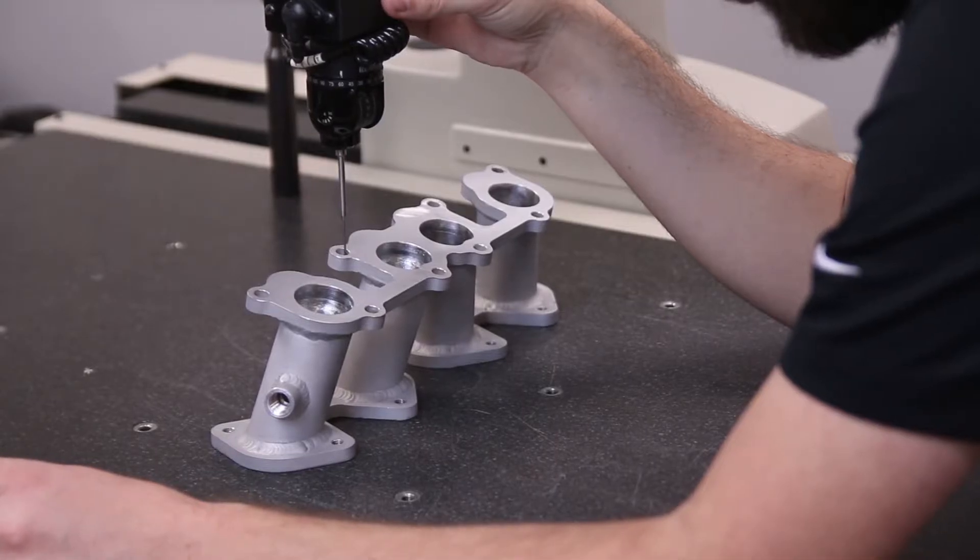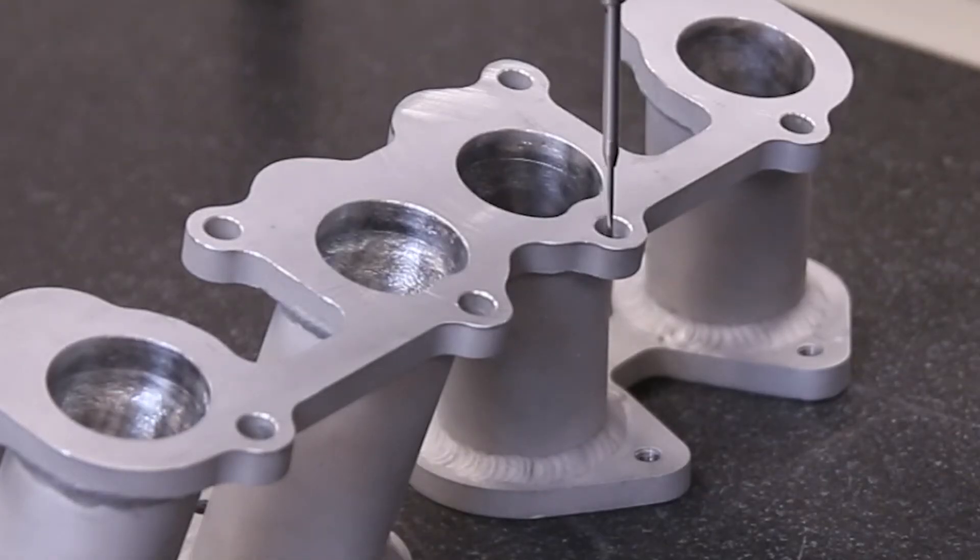The printer does a great job at it, but a machine was going to take too long and cost too much money. So in order to get to the straight tube runner, to keep costs and time down, I was able to model these nifty little templates that clamped onto the tube and allowed me to just go in with a band saw right up against the nylon. The nylon didn't budge. It made nice clean cuts. All I had to do is deburr and blow off the tube and they were ready for welding.